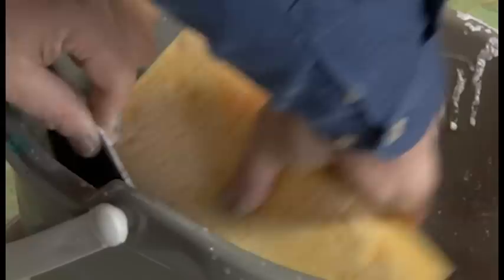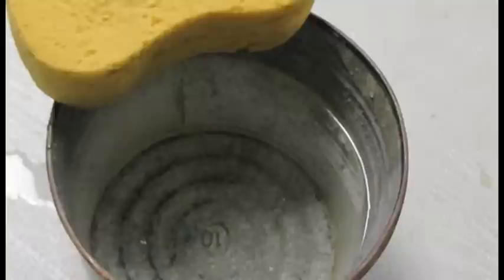It is important to completely clean your texture applicator, the bucket of water, and the sponge after the first coat to be sure it is clean for the second application of texture coat. Be sure to stir the texture coat prior to the second application.